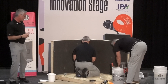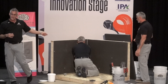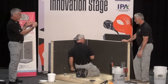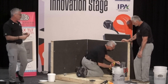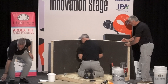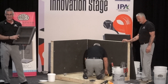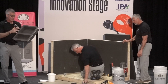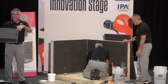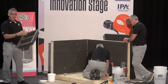The guys are just about wrapped up on the panels. Mark used the TLT 700 adhesive in that 90-degree corner right where the two panels meet — anytime two panels come together, we're going to use sealant there. We also have a variety of different-size niches available — three different sizes. What I like about our niches is they're made in one piece so they are completely waterproof. They're always 16 inches wide so they fit into a stud bay, and we have three different heights: 16 by 16, 16 by 20, and 16 by 28.